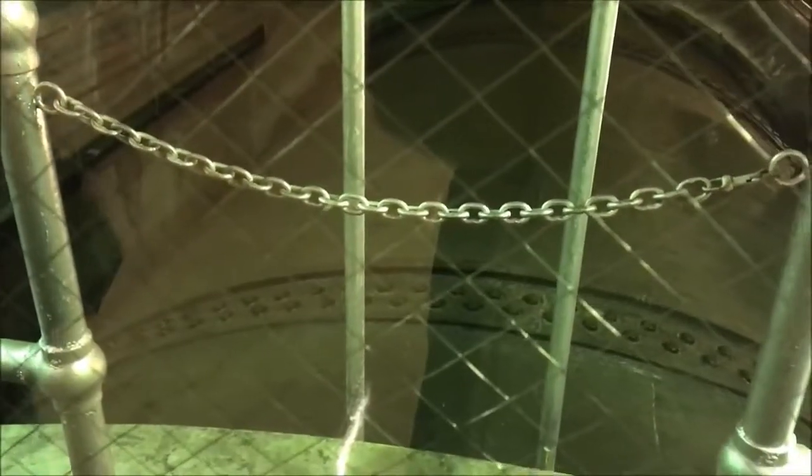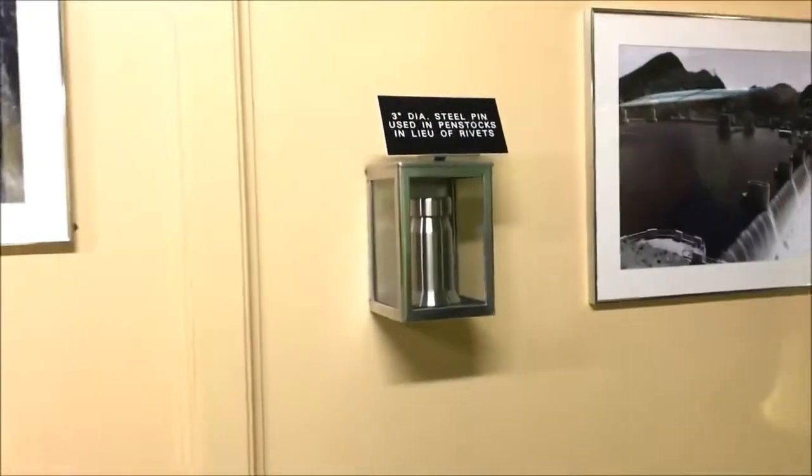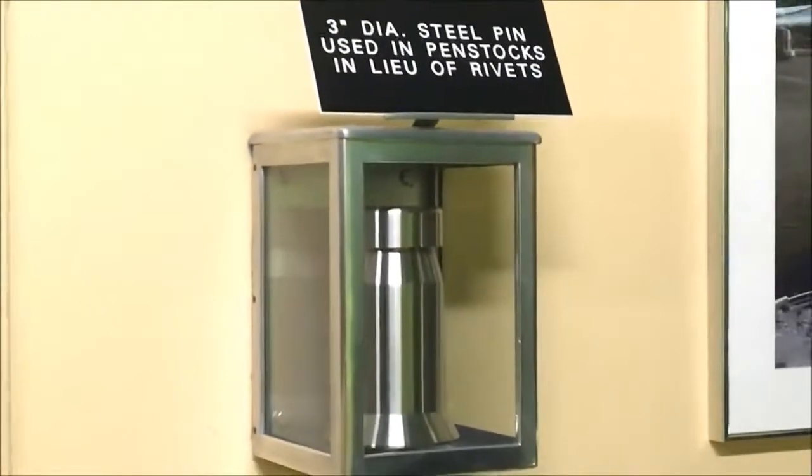They didn't have carbide, and they sat there and drilled those holes through two and three-quarter inch boilerplate steel pipes all the way around and then pressed them in. They would heat the hole until it expanded. Then they pushed the pin through, and as the cold pin went in, it sucked down on it, and that's how they sealed it. That's a lot of work.